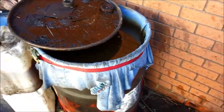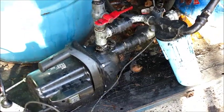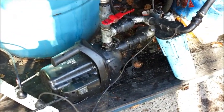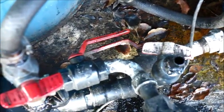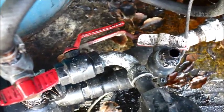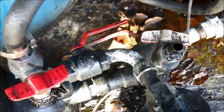From there I take it and put it in the processor for drying and fine filtering. The processor has a pump with basically two inlets and two outlets. I've inverted the drum and tapped a fitting into what would normally be the top — into the large two-inch hole — and that's the main oil feed into the pump. I've got a valve on that so I can shut the oil off if I need to separate the pump for anything. It always pays to have a valve on both ends of whatever you're doing if there's pressure on either side.